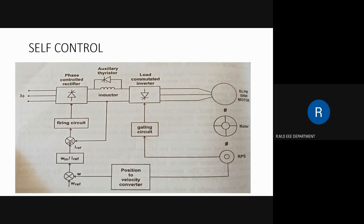When there is a change in rotor speed, proportionally, the armature supply frequency also changes so that the armature field always moves at the same speed as the rotor. With the help of the rotor position sensor, accurate tracking of speed is realized by the armature supply frequency.